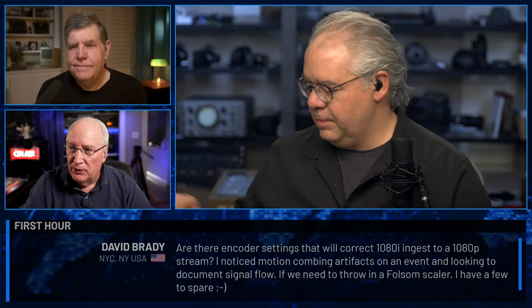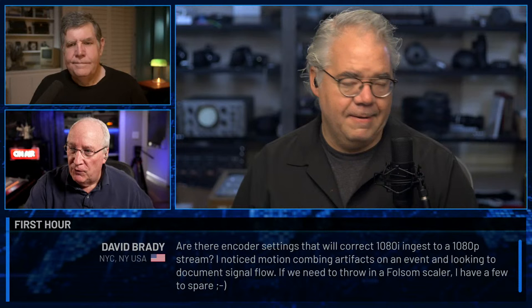That's how it works. David Brady asks from New York, New York, are there encoder settings that will correct 1080i ingest to a 1080p stream? I noticed motion combing artifacts on an event and am looking to document signal flow. If we need to throw in a Folsom scaler, I have a few to spare. There you go, Alex. A Folsom scaler should do a pretty good job.